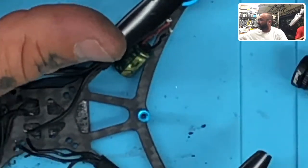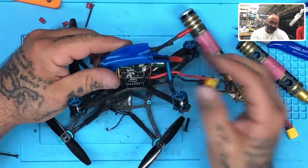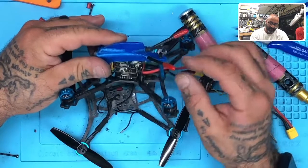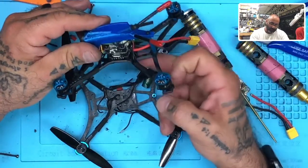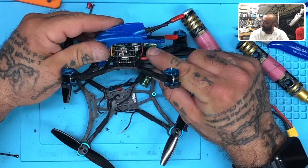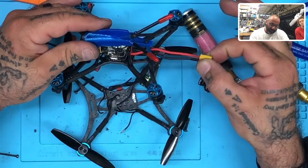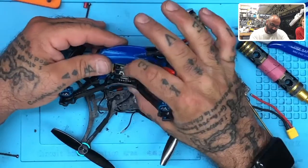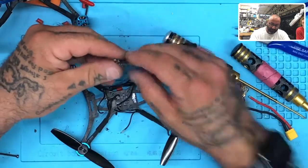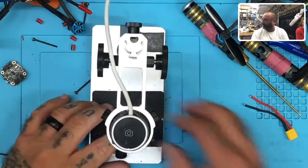Now if you were to look at a new petrol and seriously slam it into the ground, there's nothing hard up here to interact with this and compress it to make that shape happen. My guess is this person took the capacitor and moved it to the bottom somewhere down here so he could put his receiver in — because he does say he installed his receiver. So the capacitor was moved from its original spot. The drone took a hard hit, the wires popped off, and chances are the battery positive hit something around this area when it compressed. What we see now is the USB from the flight controller — look how burned this is. Let me put this under the microscope.